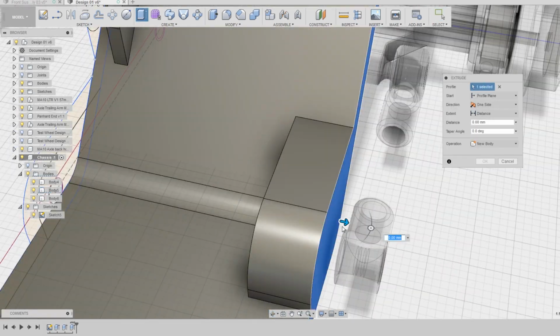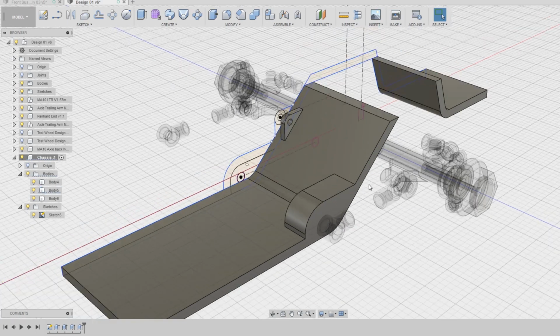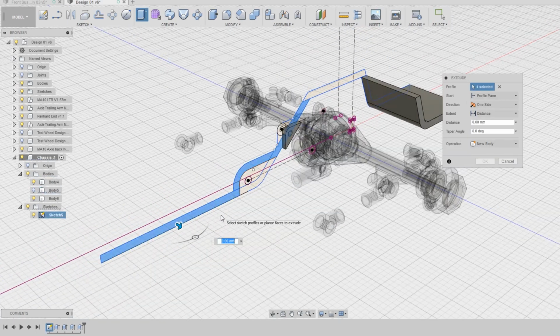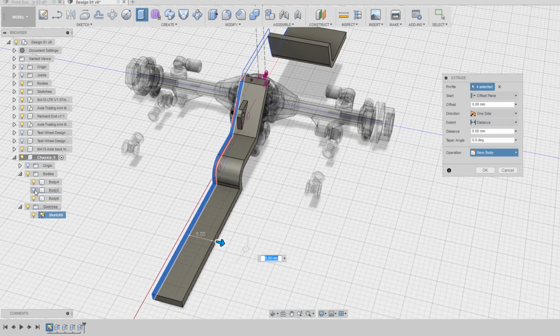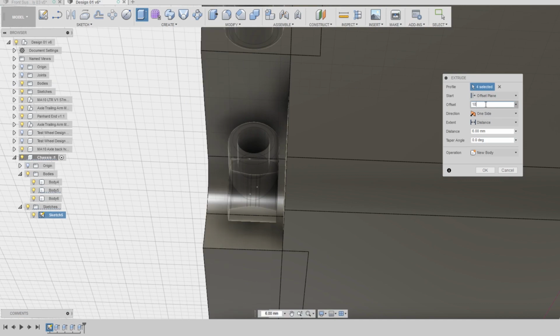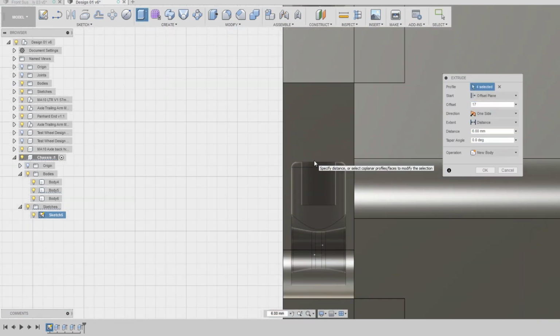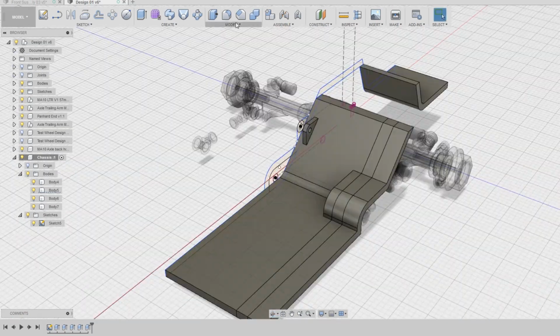I made sure that the lower trailing arm mounts have plenty of clearance, which is especially important to keep in mind when designing parts that will be printed on a wide variety of different FDM printers, especially on lower end machines and ones that are not perfectly calibrated. Fortunately, this would not be a very difficult area to do a bit of sanding and post-print finishing in order to ensure that the trailing arms can move smoothly.